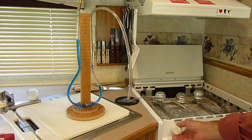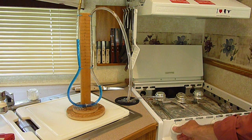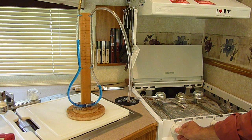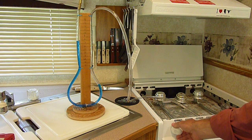I'm going to drop it a little bit more using the pilot light on the oven. This will simulate a leak — I'll press it and we should see it drop down very slowly to 8 inches of water column, and there we are at 8 inches of water column.